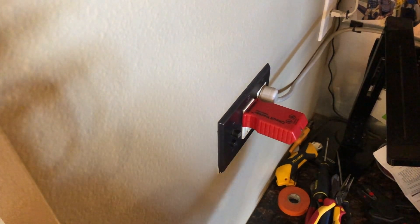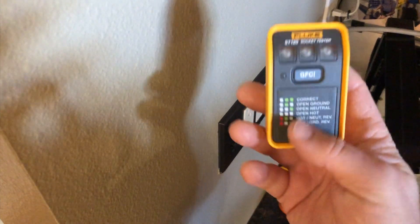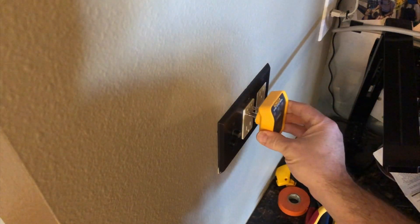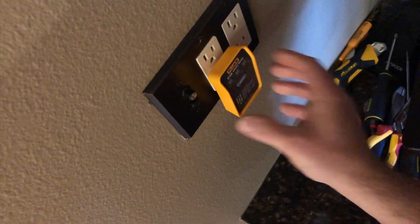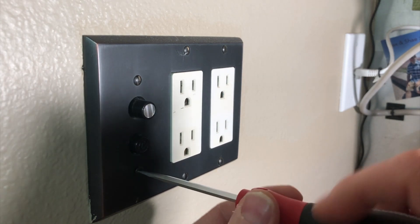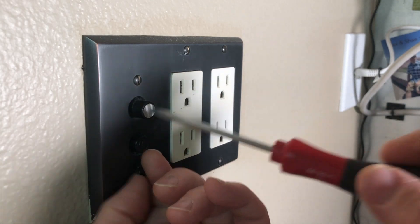Back up and you must have noticed the light turn off — there's no light here, so my computer must be down. I'll get my handy Fluke GFCI and receptacle tester. No power. No power in there — just to make sure. Yeah, good. We're all set. The beginning process is not much different than any other process of replacing a light switch or receptacle.